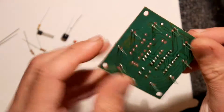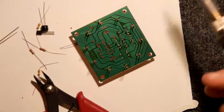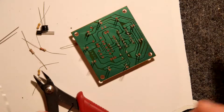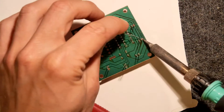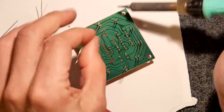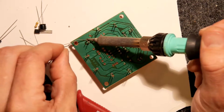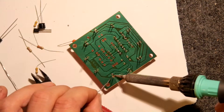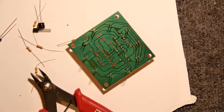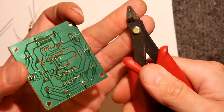These are all loosely tacked. You've got an option now: you can either cut the legs with side cutters first, or solder them and cut them later. I generally prefer to side cut them first but I'm not that bothered. What I'm going to do is solder the non-tacked leg properly, then cut them, then cut the tacked leg and retouch it - so I get to retouch the tacked leg without excess pins in the way. Take your side cutters - these are a bit mauled; I've been abusing these.